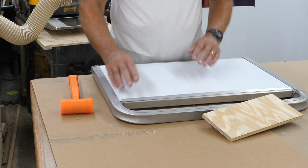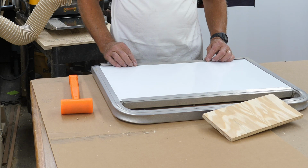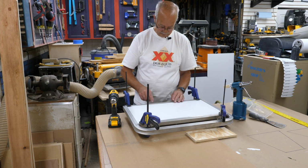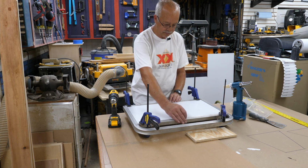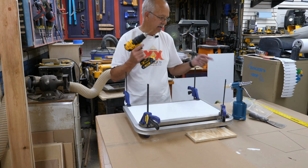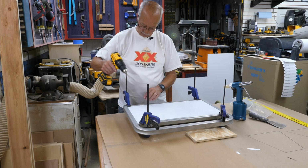So we'll get some clamps, some pop rivets, a drill bit, and we'll get this thing mounted. So, got some clamps on here, and got this kind of where it goes. I'm going to have to do a little bit of fudging here with it. The strips are not completely flat, but 1/8 inch drill bit, 1/8 inch rivets, aluminum rivets, not steel, because those would rust.